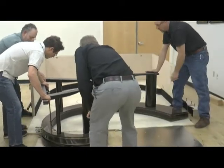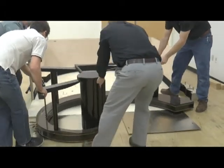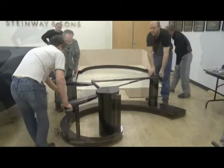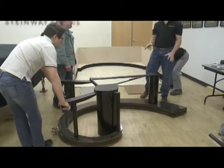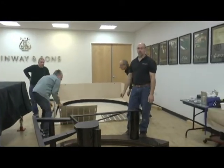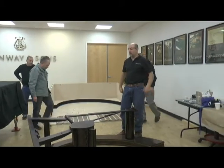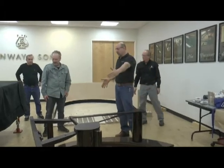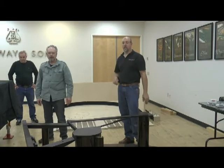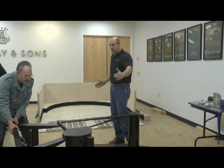Keep your two posts over the ramp because that's where the wheels are. The weight of this base is significant — approximately 600 to 700 pounds — so maintain pressure on it while rolling it down. At this point we're ready to roll it underneath the piano. Orientate it in the right direction and check your clearance, making sure the piano is high enough as the base rolls under to clear everything. We're going to rotate the base into position.